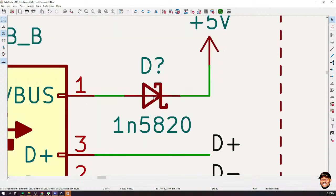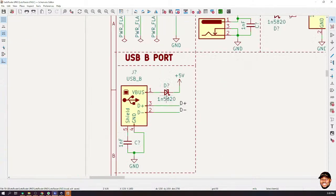And it's the same thing. In fact, over here, actually, this is too much for this line because we are using USB 2.0, and USB 2.0 can actually give, I think, a maximum of about 500 milliamps. So later on, I'm going to search and see if there is any Schottky diode that can do about 1,000 milliamps. I'll replace this with that. Yeah. Okay.